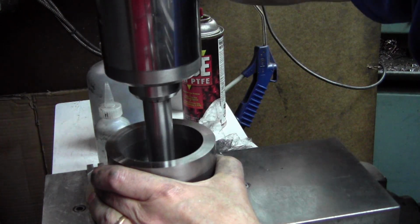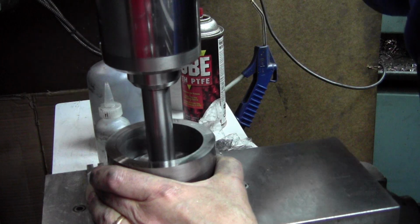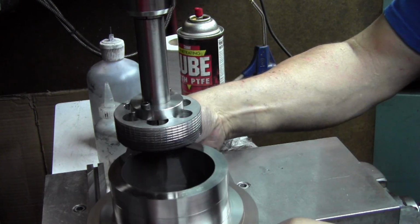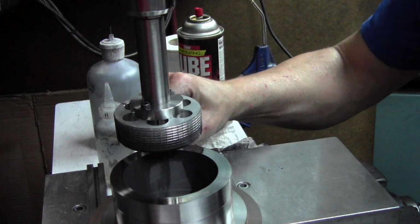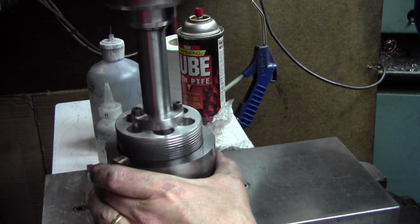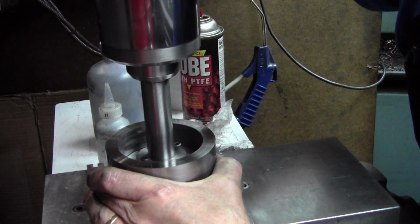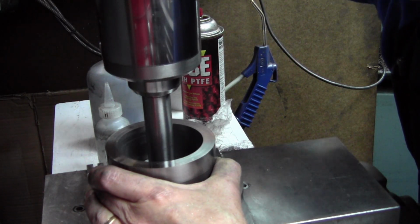So the reason I'm working at the bottom of this at the moment is because there's a little bit of taper, probably maybe 3 or 4 tenths, in these from me hard turning these. This is like 60 Rockwell D2, so not trivial stuff. And D2 is 12% chrome, and chrome is pretty abrasion resistant, so not crazy hard to lap, but it's tougher than your average steel.